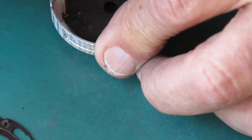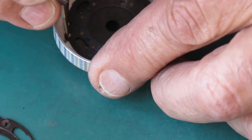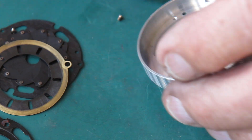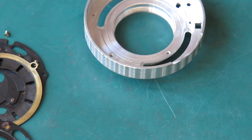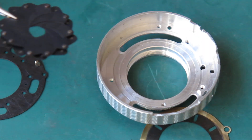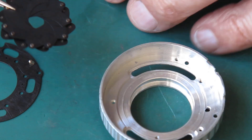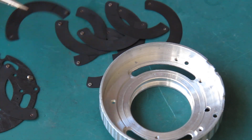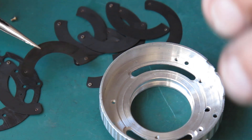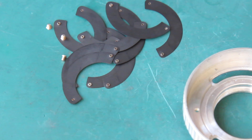You need some friction there so it doesn't shift its position unexpectedly. But you don't need as much as that. Particularly as this shutter has click stops for the aperture settings — not very exciting click stops, but click stops nonetheless. If it had none, you'd want a bit of friction in that settings arm; otherwise you'd be tending to accidentally knock the aperture settings when lifting the camera to your eye, and that would mean exposure problems.